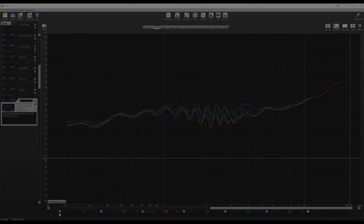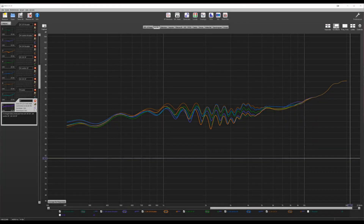This is the final set of measurements. I measured the response in three different exciter positions: the traditional two-fifths/three-fifths position; the three-quarter and centred position I used in my Goldie panels; and the wildcard three-quarter/three-quarter position, just for fun. I then did the same with the 40-watt steered flux exciter, to see which model was best suited to my panels. The measurements are only subtly different. The green line is the two-fifths/three-fifths position — it looks pretty good — but the three-quarter and centred position actually looks slightly better.